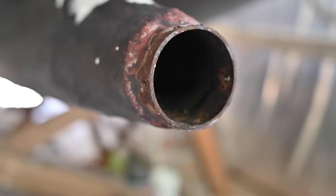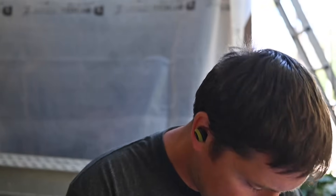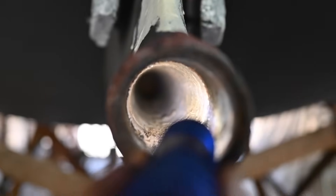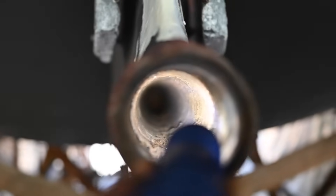So that's what the new bearing is going into. But you have to do some work before the bearing can go in — we have to clean the stern tube out. I'm not exactly sure how I'm going to do that yet; I think it's going to involve a drill and a broom handle. It has to be wire brushed. Now that we can actually see up here — oh, it really doesn't look that bad. Can you see in there? I was expecting it to be rusty, but yeah, it doesn't look rusty at all.